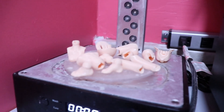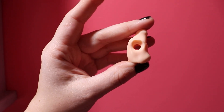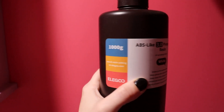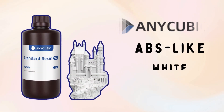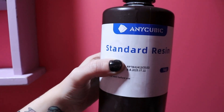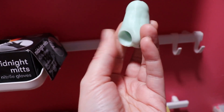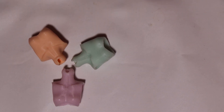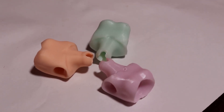I'm going to compare this resin to two other resins I use on a regular basis. The first comparison is to the Elegoo ABS-like — I used the white as a base and made a baby pink color. Coming out of the alcohol wash you can see that the print lines are more noticeable and the resin is definitely softer and more fragile. The second comparison is to AnyCubic Standard White, which I tinted a light minty green. Coming out of the alcohol wash, this was firmer than the ABS-like but softer than the Rezion. I also ran a batch of Rezion with tints mixed in just to make sure the tints were not affecting print quality and giving the Rezion an unfair advantage.